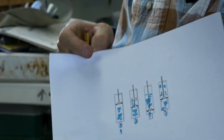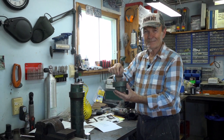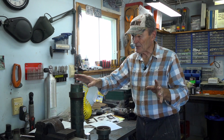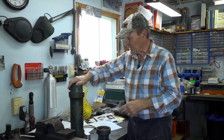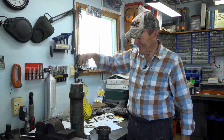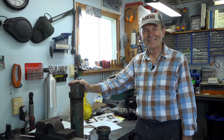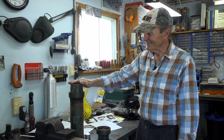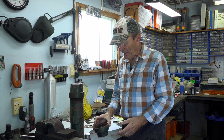This is really the simplest device in the world — a piston with a one-way valve and a one-way valve on the bottom. That's all there is to it. These pumps come in a dozen different sizes: two inch, two and a half, three — this is a three and a half inch, a BD pumper, the one we're going to use on the well. All you need is water, a pipe, and a rod to make the piston go up and down, plus the leather seals. That's how it pumps water. These are all genuine parts from the early 20th century — around 1910 to 1920.